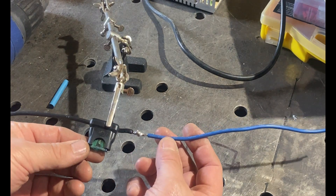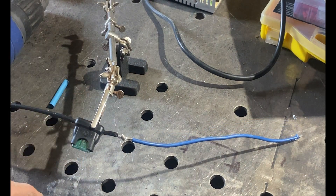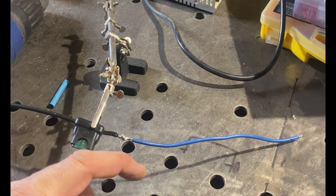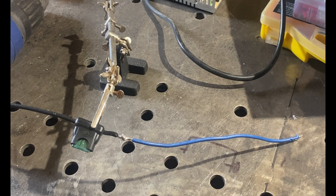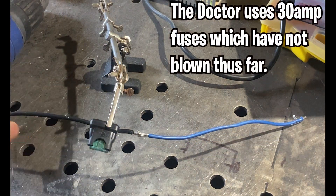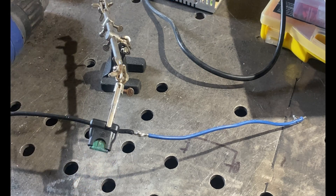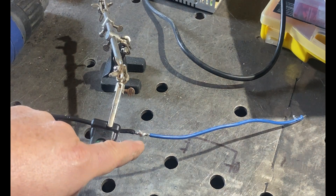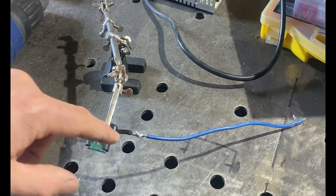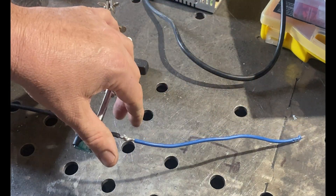As mentioned in the first electronics overview video, I talked about running two lots of fuses for my setup — fuses from the power supply to the IBT2s, and then a fuse from the IBT2s to the motor. This is a good idea; a man can never have too many fuses. Here I'm setting up the wiring that will go from my power supply to my IBT2.